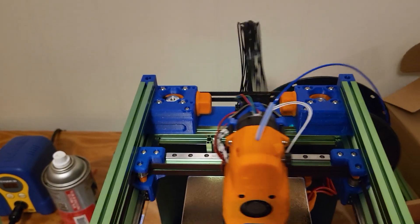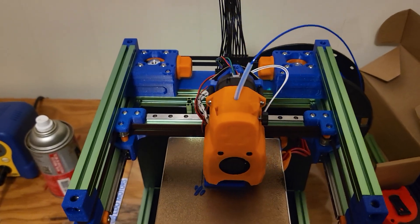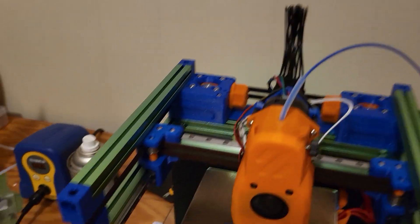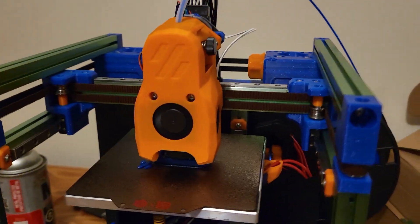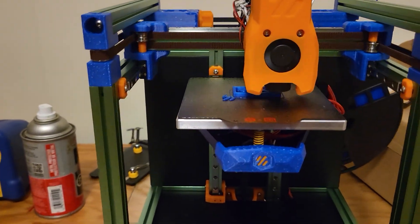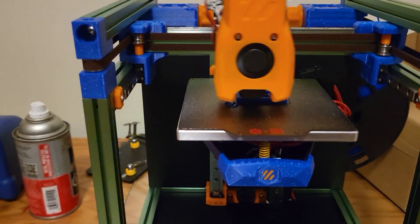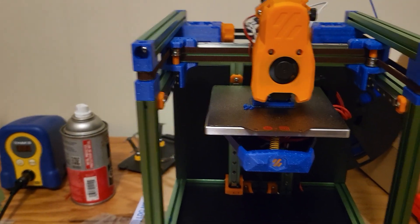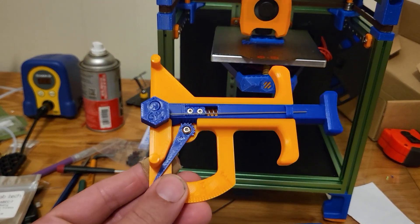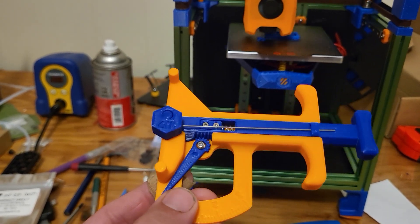Inside the community tool used for input shaper values, there's also a tool called belt shaper that lets you frequency-tune your belts so they're matched in frequency. I haven't gotten that far yet in my journey with these machines, but I'm planning on doing it very soon. For right now, for belt tension, I use this wonderful tool here — it's by a fellow called PF — and it measures the tension on the belt.